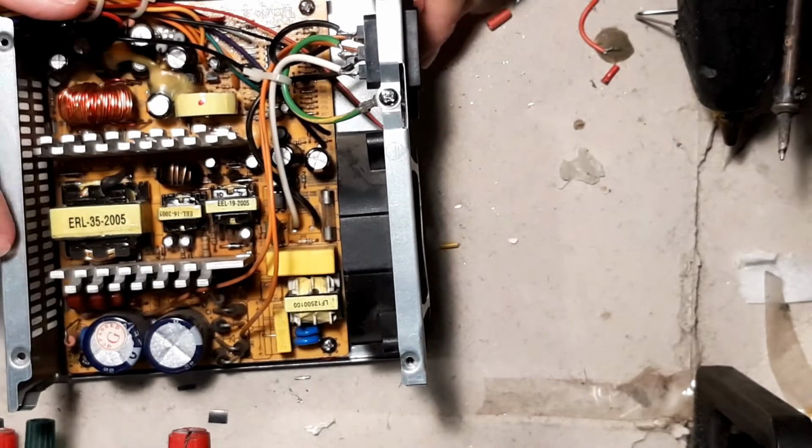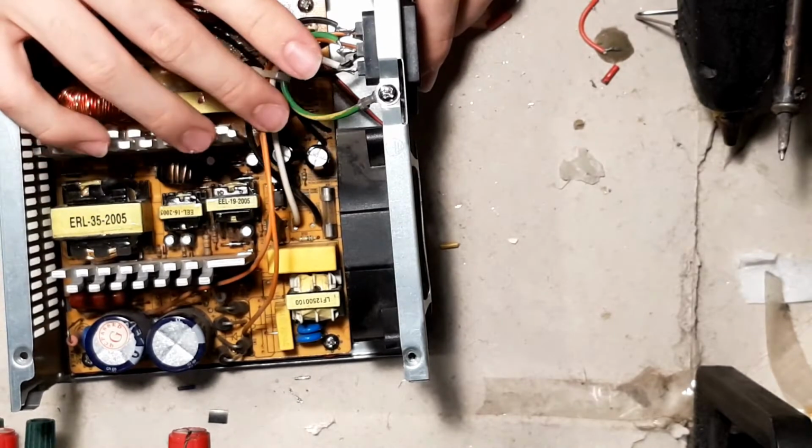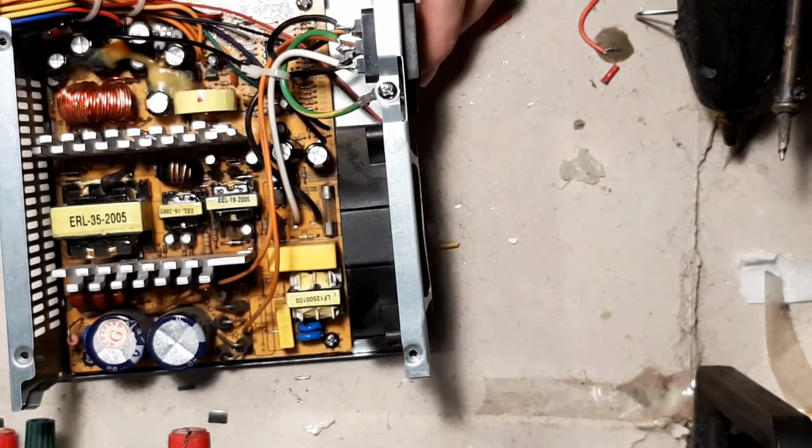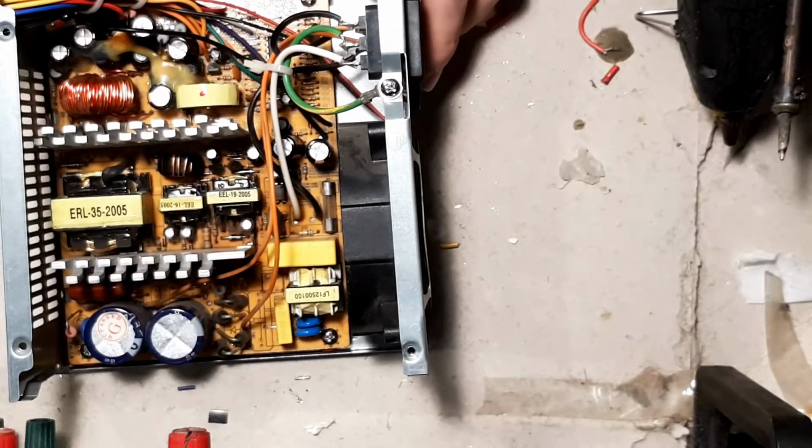You can now connect this in series. Do this to all your power supplies except one. You can do this to all, but I'd like to leave one grounded, so it has reference to ground. You don't need to do them all. Like only this one's ungrounded. The other one is fine.